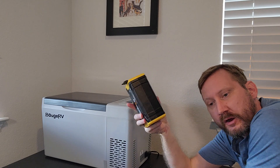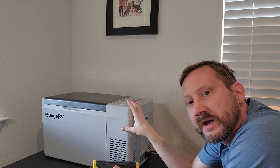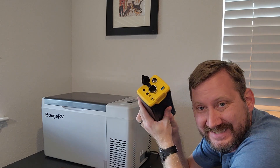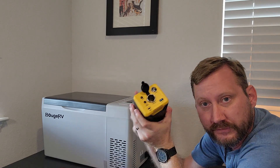However, if you're just talking about a day trip — camping, tailgating, or something like that — and you have one of the little power packs, this solar panel will actually plug directly into it and extend the life of the pack. Since this thing only draws about 50 watts, you'll be running off solar and charging the battery. When the sun goes down at six or seven o'clock, the battery kicks on. But since the battery pack is only about six hours, it's not going to make it all the way through the night to the next morning. So just not quite big enough — this would extend you for a day but wouldn't keep it going continuously.